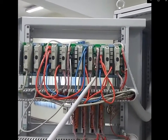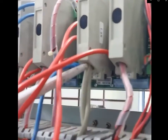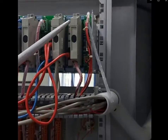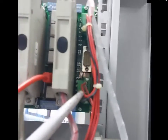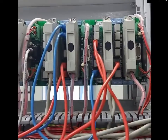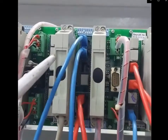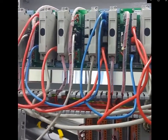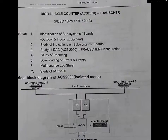Five sensors are connected to three track sections. The connector carries four conductors of DP1 and four conductors of DP2, terminated on the processing board. To the rear of this processing board — the motherboard — one connector is for reset and relay, and two connections are for power supply to process the input and output data coming from the field to the indoor equipment. Color-coded cables are connected: the blue color is for the wheel sensor of each DP. DP2 is shared between track section 1 and track section 2. The red color conductors are for putting that sensor into deactuate mode to suppress post-roll counting.